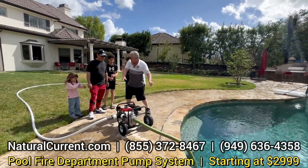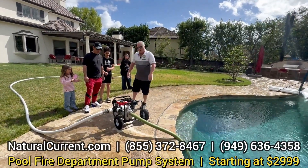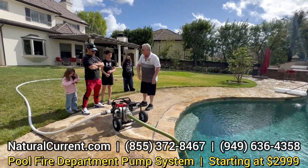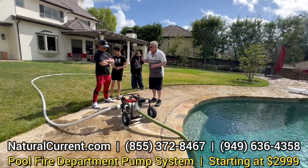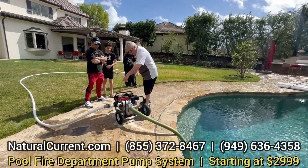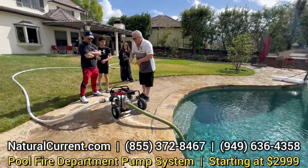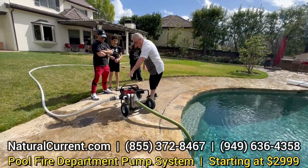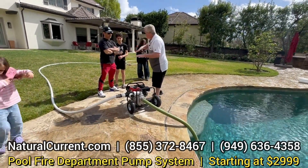Now what are we going to do? Let it idle first. You just want to turn it off — unless it's a fire, then you're out of here, just cut it off. Hit that switch and you're out. But if you're testing and checking things out, let it chill for a minute before you kill it, just so it can all kind of wind down a little bit, lose a couple degrees. The oil can kind of do its thing. So it's just smart to do that. Now we don't see any leaks. So that's the goal we want to achieve. If it's dripping a little bit, it's not the end of the world. But when you're testing it and you see a leak on this particular valve, then we take it apart when we're done and put some new plumbing tape on and just note that spot.